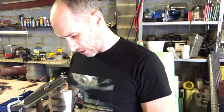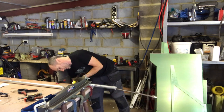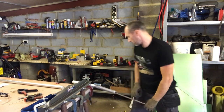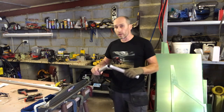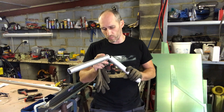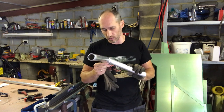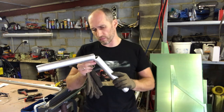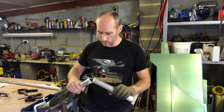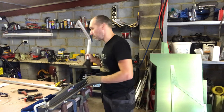More penetration required. The crack started propagating from the top, but what we actually found is that the material to the side of the weld cracked - the weld itself is intact. That's the kind of result we want. So now I should continue welding the same way as I did this one, and we'll start welding the roof rack up using the same settings.